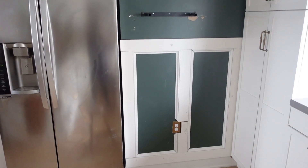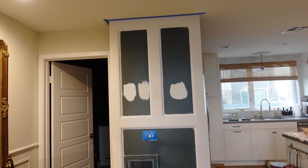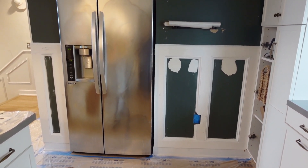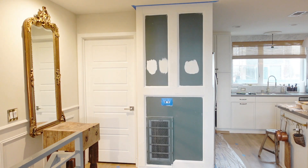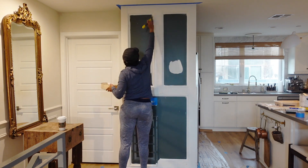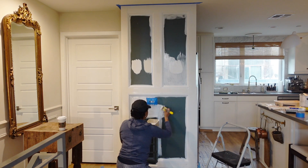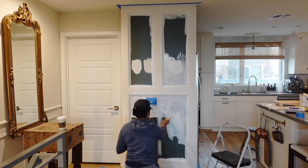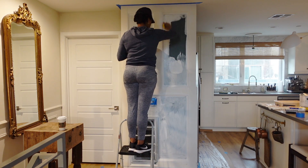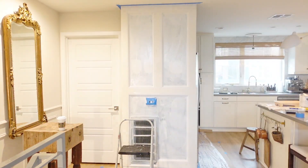You can see there are a lot of gaps, and I will be filling those with caulk and spackle. I don't show it because it's boring to look at, but this is what it looks like before and this is what it looks like after. You can see it's super seamless - once it's caulked and spackled it's a uniform look and it looks like it's just a part of the wall. Next up, I went in with some primer. You do have to prime the base cap molding if you use the same one I used because it's not wood - I believe it's like a vinyl exterior - so you want to make sure you prime it. I'm also priming the entire wall because I'm painting this with a lighter color over the green, and Zinser is truly the best primer.